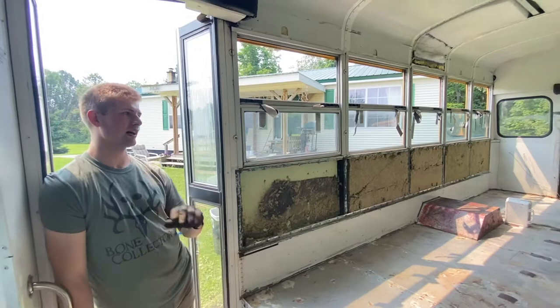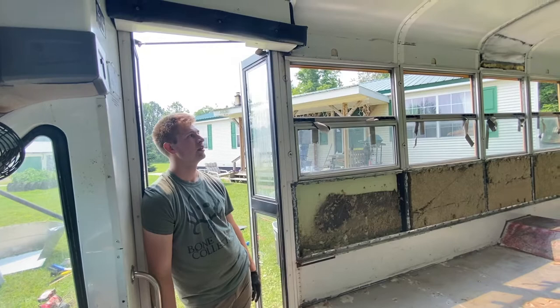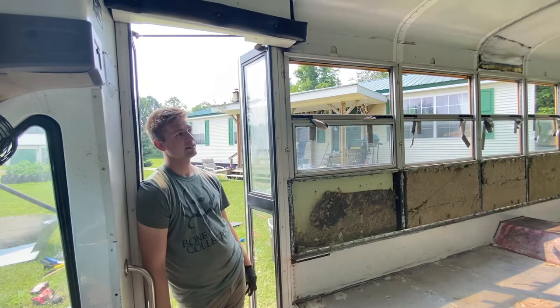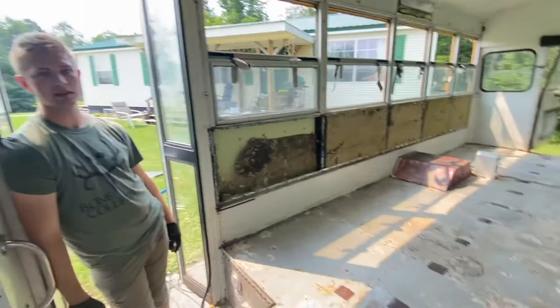There's so much hammering involved that we're just going to leave the roof as is, insulate over the roof, and then put whatever material we're using over the insulation — because too many people say it's dumb not to insulate and wish they did. So that's the plan. The next step is to paint the floor with the sealant paint.